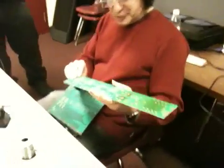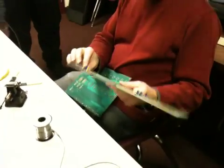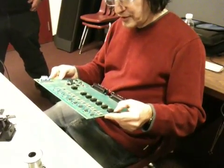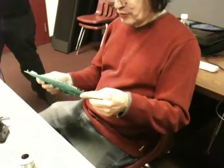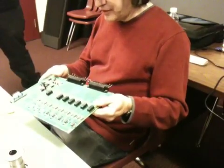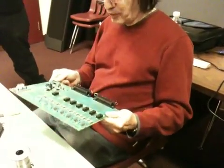This is the regular type of PC board — one-sided, with foil on one side. You can see many components have been removed from it. That one is a double-sided PC board with foil on both sides. This is more complex to solder and desolder. The advantage of a double-sided board is that it reduces space — this board would probably be four times longer if it were not double-sided.